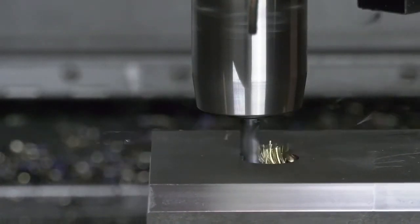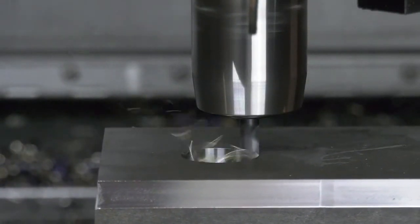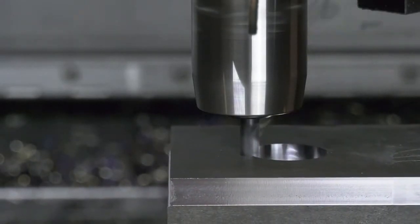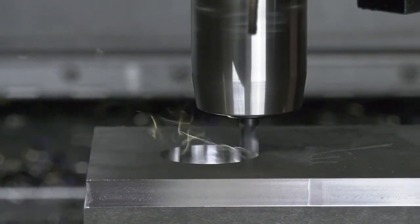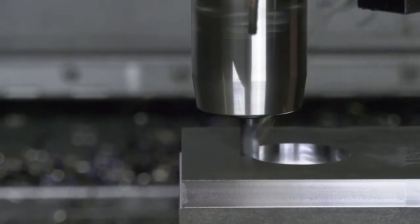To open up this pocket, we're going to be using power milling, or what we like to call heavy duty milling. That's where we slow down our cutting data but increase our radial engagement. We're running at 400 surface feet per minute, 2 thou per tooth, but we've increased that radial engagement to 60%, so we're really taking off a lot of material in each pass.